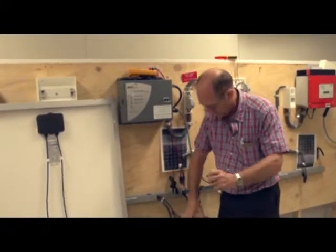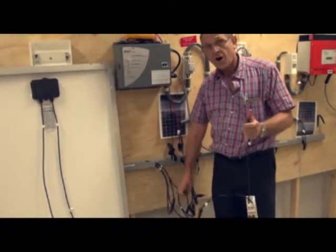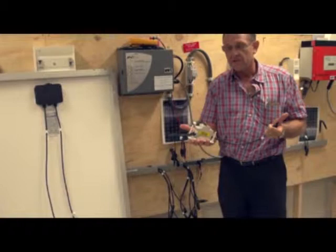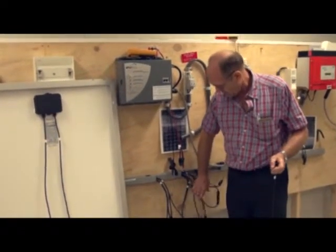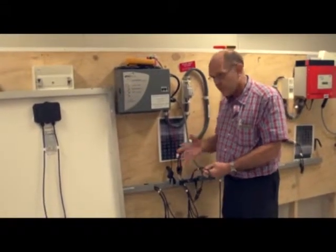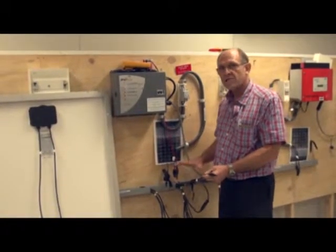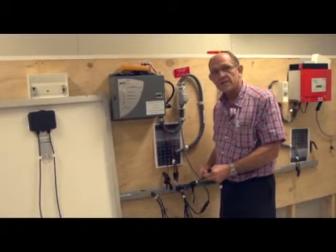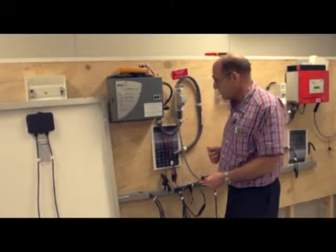I disconnect it. These little plugs are offload disconnection devices — the fact that I'm capable of opening the circuit means I can plug them in and out quite comfortably. I will do that three more times, and that will give me the start of my warranty profile, having checked each one of the strings individually for open circuit voltage and short circuit current.